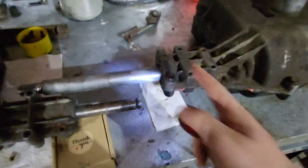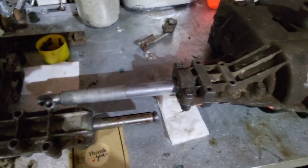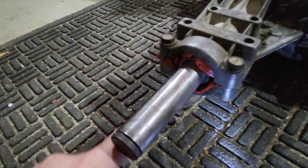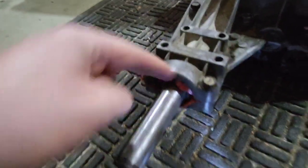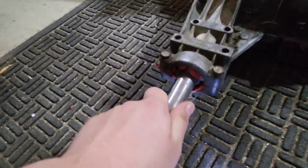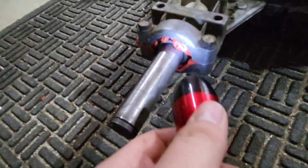As you can see, there's silicone over top of the bearing. When you seal it up, you lay it all around and obviously go on top of the bearing — I never thought to do this. What I did on this one is I lifted the bearing up, laid silicone underneath, set it back down, then went over the top. I did that on both sides and set this thing overnight so all the oil would drain to this side — not one single drop dripped out.